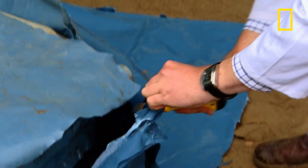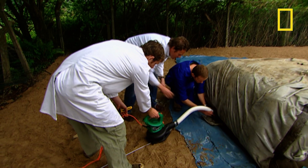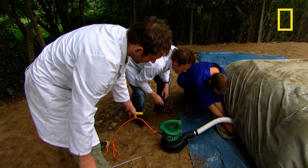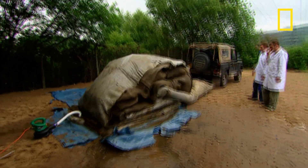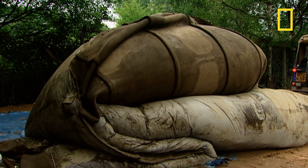At this point, there's a window of around five hours for the canvas to be raised into its final position before the concrete starts to set. Next stage is to fit the blower. The blower's on. The only other bit of gear you need is something to drag out the cloth so it's completely unfolded before it's inflated.